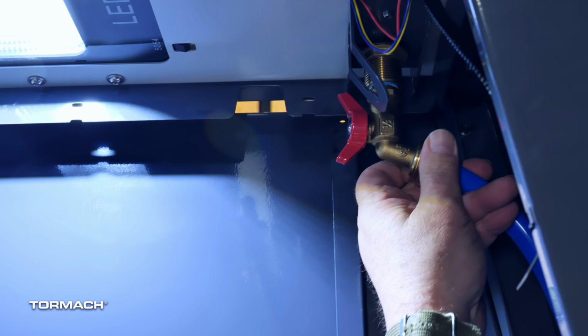Find the hose and manual sprayer. Make sure the rubber seal is installed in the fitting and then secure it to the hose bib. Hang the manual sprayer onto the bracket. Find the 7-foot by 5/8 inch OD hose. Route this hose from the back and through the channel running down the middle of the top panel. Connect this end to the elbow fitting with a pair of pliers and the hose clamp.